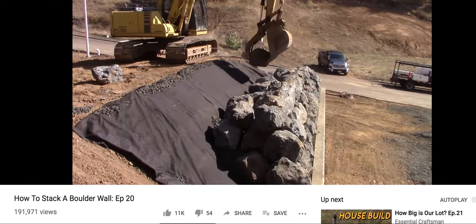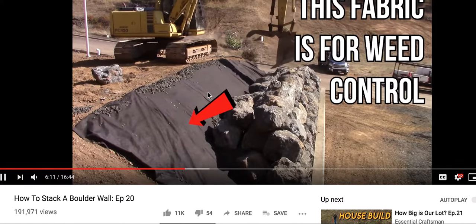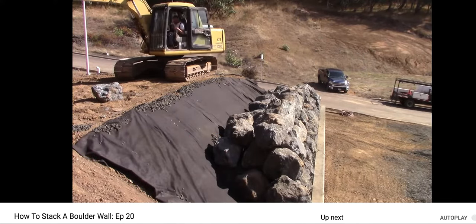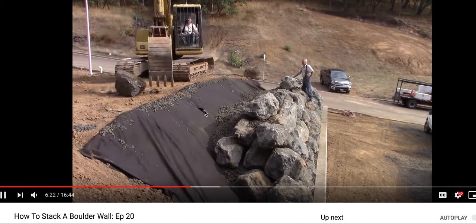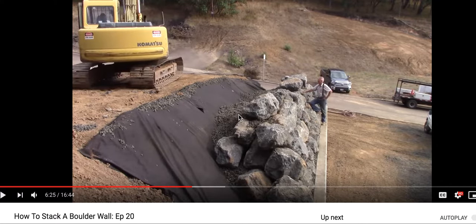Carl Broda specified the base course of this rockery to come up a certain distance. They knew how high they had to come, how wide it had to be, and what the slope needed to be on the face. Look at these things — he's moving them in half-inch increments, wiggling them into place, tapping them down. All this will create water going straight down there. You're going to undermine the soil, and you have the load source. This will cause the top to go over. This is just crazy.